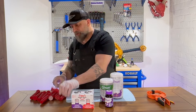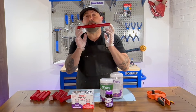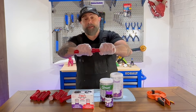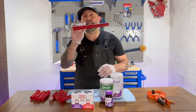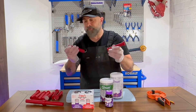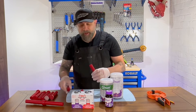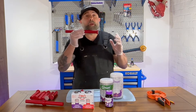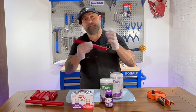Let me show you what I'm going to do. We're going to take these pieces — this was from our test of different types of 3D printing glue. This was our 3D Gloop one, and we could not break the bond; it actually broke by twisting apart. We were able to snap it, but it didn't break the bond — it actually broke the PLA. We're going to use the same sort of test and recycle these since we've destroyed them. We have the ones where we used liquid nails that didn't bond. We're going to bond them with the Gloop or the PVC glue, clamp them, leave them overnight, and then test them to see if we can snap them apart.